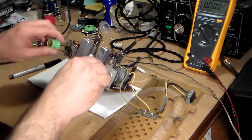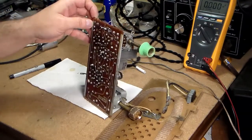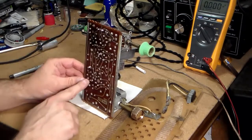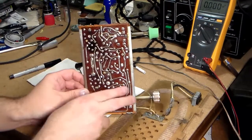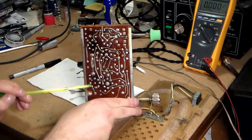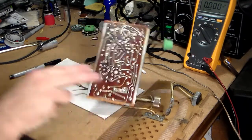Well, now it's kind of kludgy here, but I started testing the voltages, and it didn't take me very long. So the first thing I did was, I knew 120 was coming in. The 35W4 is here. I can turn that around. Grab me the pointer. So here's the hotline comes in here. So, you know, I had 123 volts here. And I put a mark here where the tab was. So, you know, pin 1.